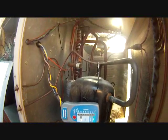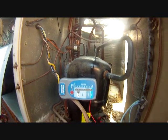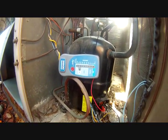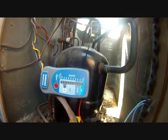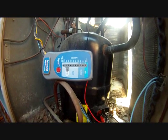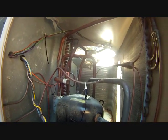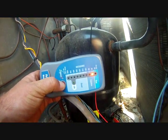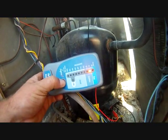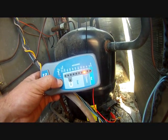I got done with my stuff here and I was just going to hook up the megohm meter to make sure that whatever caused our electrical problem was not going to be an issue anymore. And I got a low reading — low being bad as far as impedance. So I hooked up one of the windings of our compressor here to one of the tubes, and we were relatively low there — 40 and up to about 60 megohms. So we're pretty low.